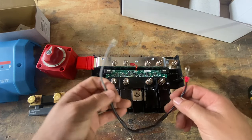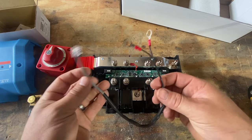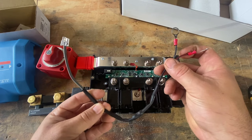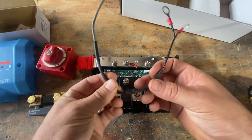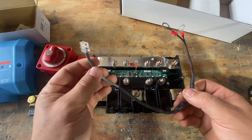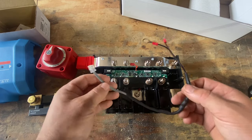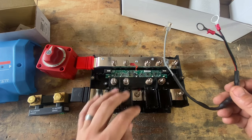And again, one of the things that we like to do is add this special cable that we've talked about before. It takes 12 volts in, runs it through a little step-down converter that's buried in here in the heat shrink, and then puts it out to 5 volts to 2 pins here. And this makes all the lights on the Lynx distributor work the way they're supposed to.